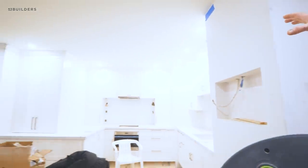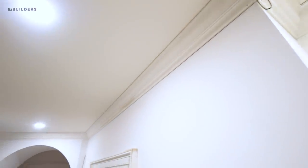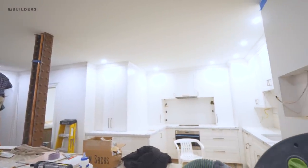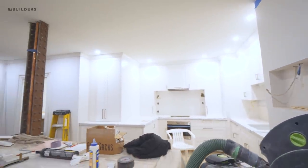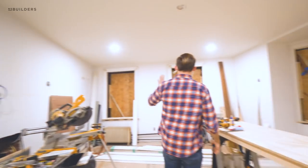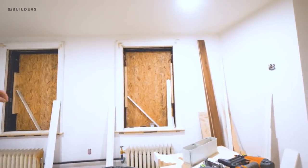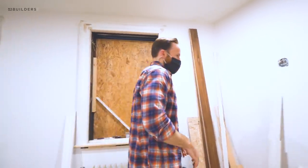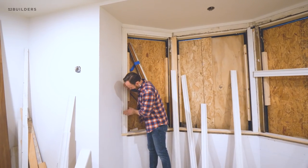It's a tight site so we've got two saws set up, but standing back, this is a big reason why we installed these cabinets all the way to the ceiling — that crown molding is actually the same profile as the crown molding on the cabinetry. The cabinetry is all factory painted and the trim in the rest of the room will be sprayed in place, but it'll be the same color, so you have this consistent crown molding all the way throughout the entire space.